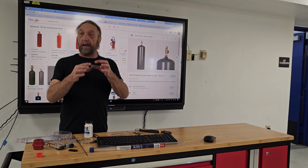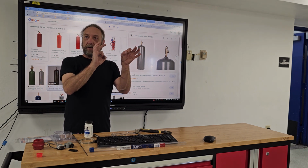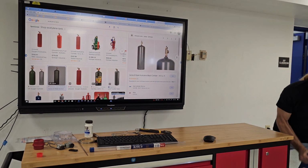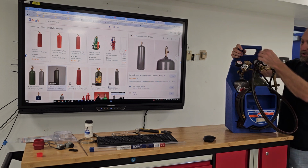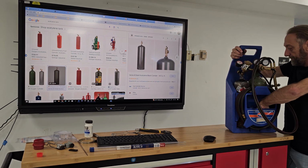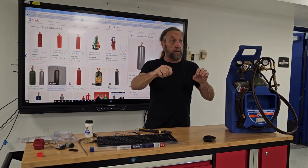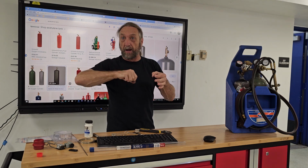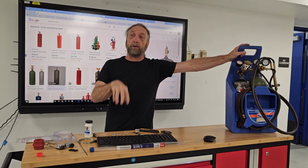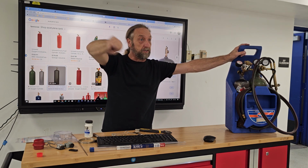We do have just a little tiny piece of metal that has a square hole on it. And a lot of times they have a chain, and they'll leave that chain attached to your torches so you don't lose it. It's not here. But we also have one in the cabinet that's ratcheting. It's like a box wrench, ratcheting box wrench, but it has square holes. Refrigeration techs use it to open what we call king valves.